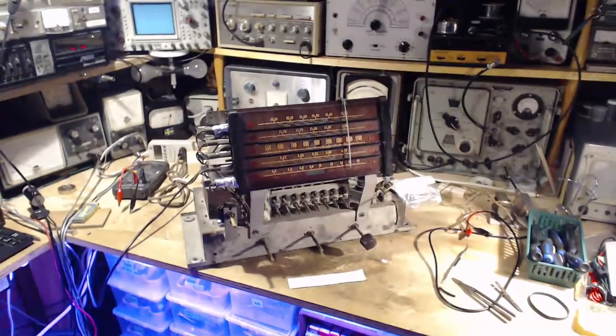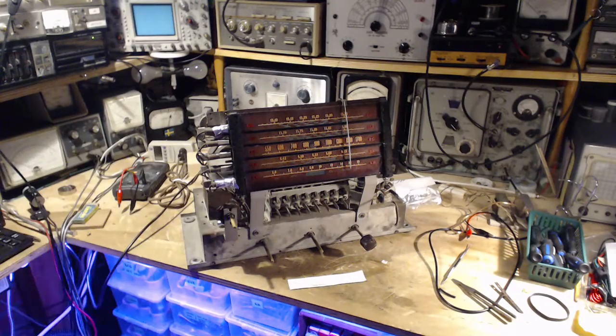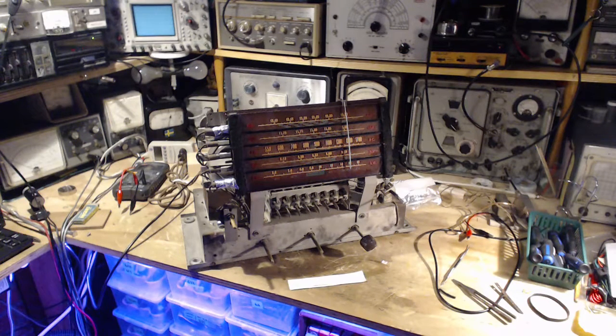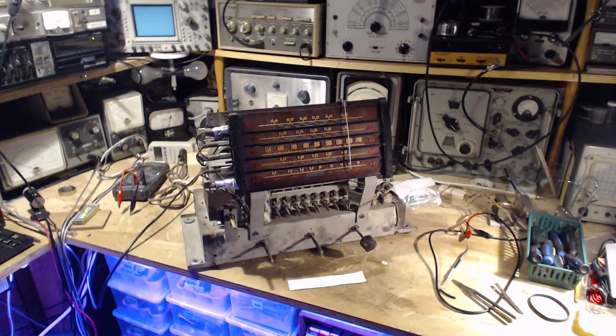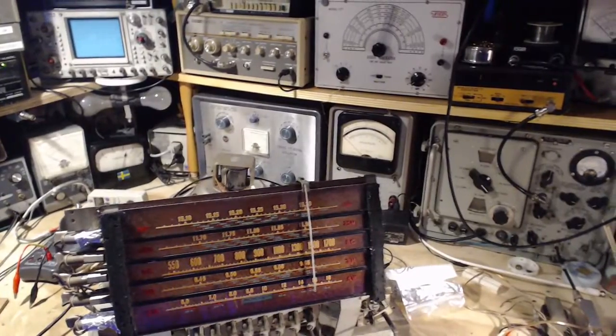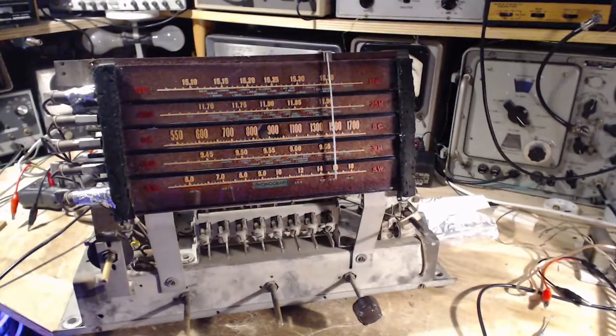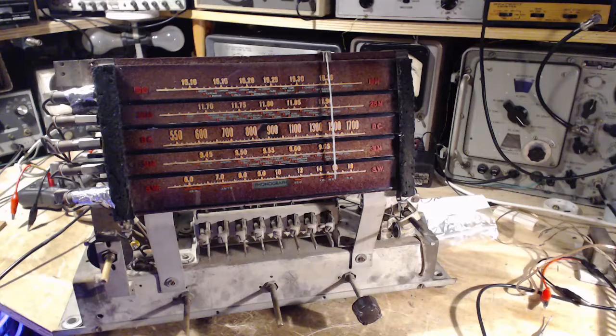So what I want to pursue today, I think, is the 31 meter band, 9 megahertz band, which appears to be almost non-responsive relative to all the other bands. So why that is exactly, I have no idea. I'm really not too sure just what could happen to one band that wouldn't happen to all the bands, but one possibility is very bad alignment. That's a possibility. And this issue around is the local oscillator above or below the target frequency.